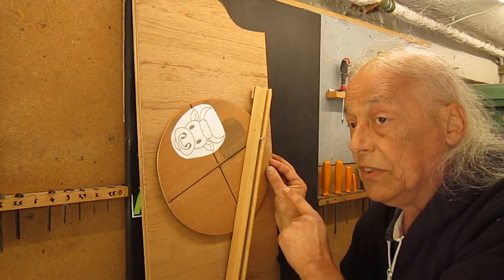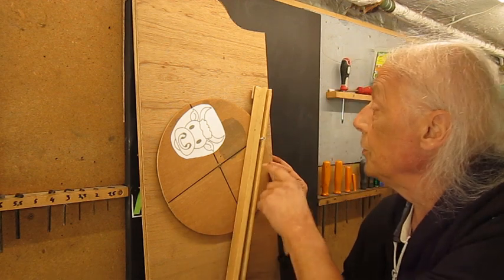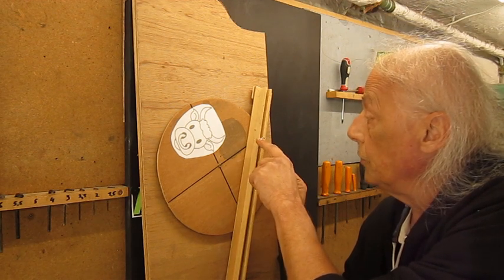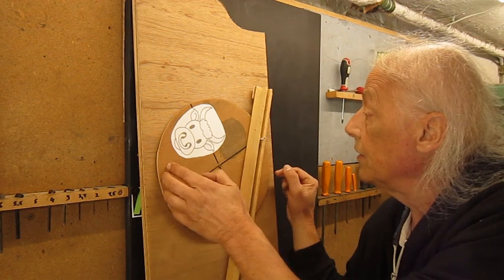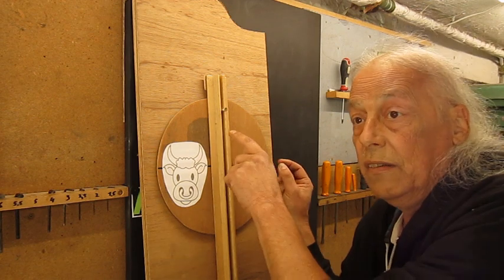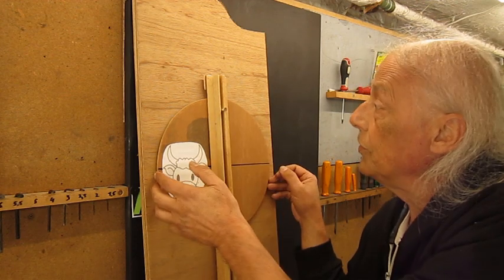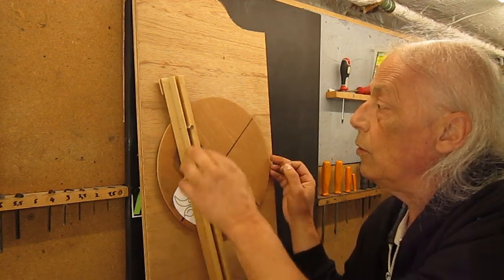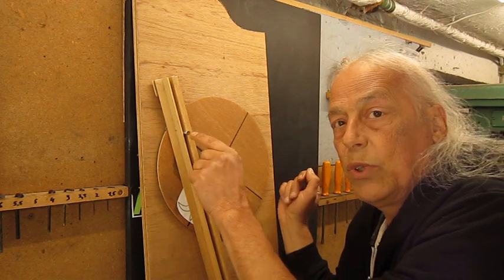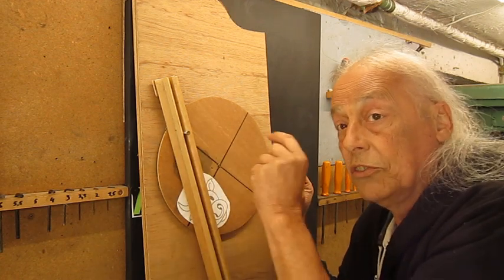If the cutting forces are high, or even with low cutting forces, from the moment this crankpin is forced down — that's not complicated. In the middle of the stroke, the crankpin is forced backwards, so no up and down forces. Then the crankpin is forced up. So if this crankpin is not really tight, there could be an up and down movement while spinning.